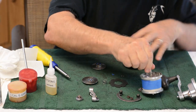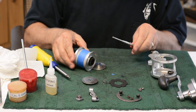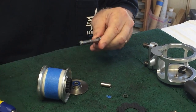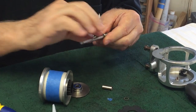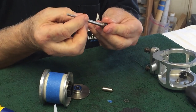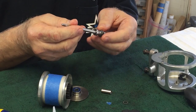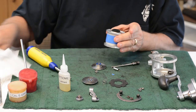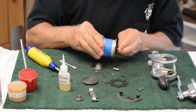Once that's clean, you can go back to the rest of this. Pull this out and what you'll get is a sleeve. There's another bearing here. You can clean the spindle and oil it. I have a hold of this end — I don't take any of this off. This bearing can come off and there's another sleeve inside, but I keep it as a unit. These Belleville washers are tricky if you get them off and don't know how they all work. There's another bearing — clean in here, then put this back in and it clicks into place.